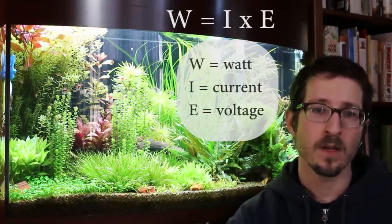I'll give you one more formula for wattage: W equals I times E. Using the formula with constants of voltage and a 15-amp circuit breaker, W equals 15 amps times 120 volts, which equals a total of 1,800 watts available for a 15-amp circuit. Each device plugged into that circuit branch adds to the total wattage being used and the heat being dissipated. Overloading the maximum capability of a circuit branch could result in heat damage to the devices and the electrical wiring, and in the worst case, could result in an electrical fire.